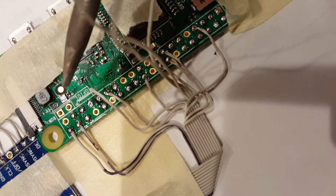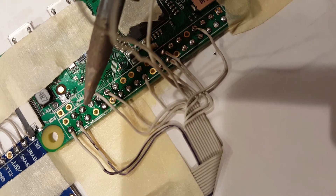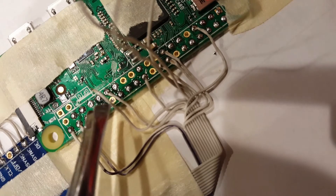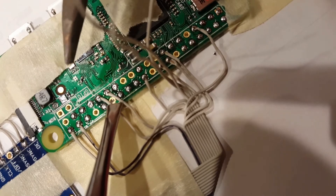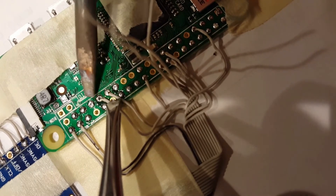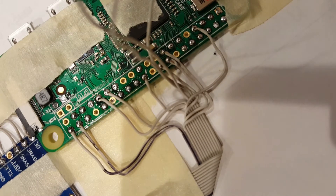I use the heat shrinkage to my advantage — I just cut the wire to length, put my soldering iron on the end of it, and the sheathing shrinks away from the edge just enough. Then using your tweezers, you heat up your solder and pull it right in there. Pretty simple — it's completely covered and won't short, and you don't even have to bother grabbing your strippers.